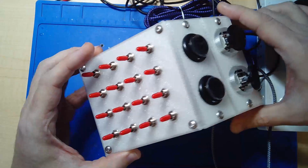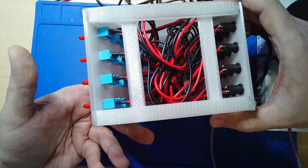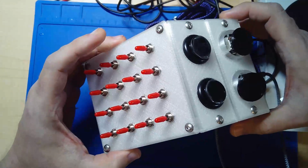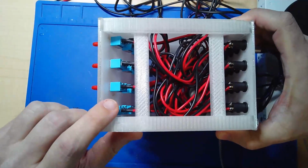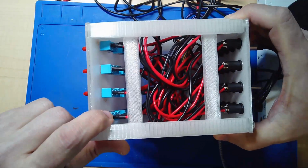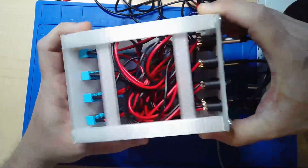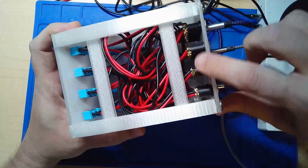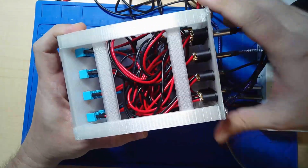put together, and it has a whole bunch of wires, as you could tell. If I was going to do this in production mode, I'd probably use a printed circuit board setup, but this actually was not as bad as you would think, because you can get these switches pre-soldered, which I highly recommend, because soldering these switches notoriously breaks them. So I did the soldering on all of the jacks, and it was a lot of soldering, but really not complicated.